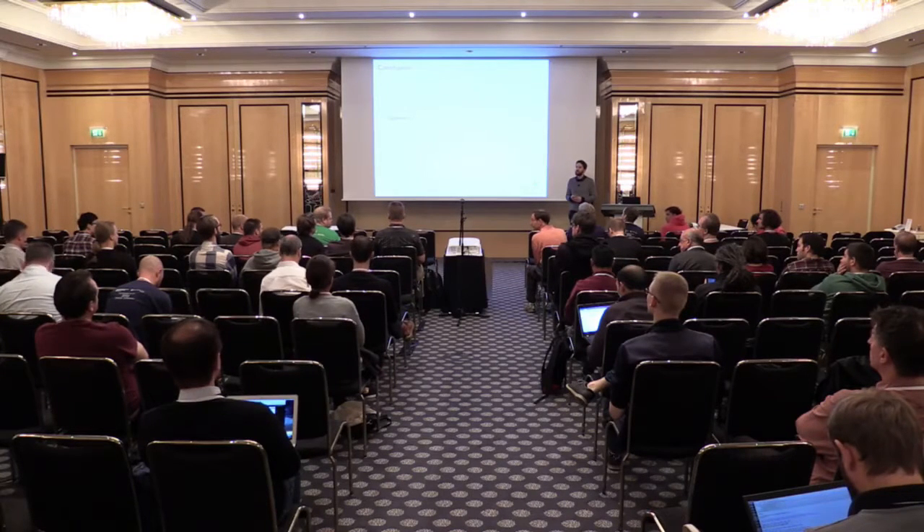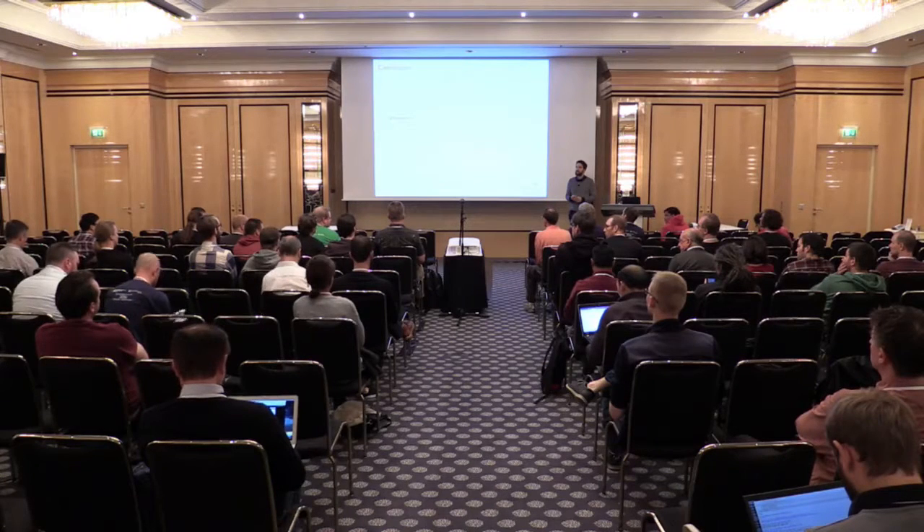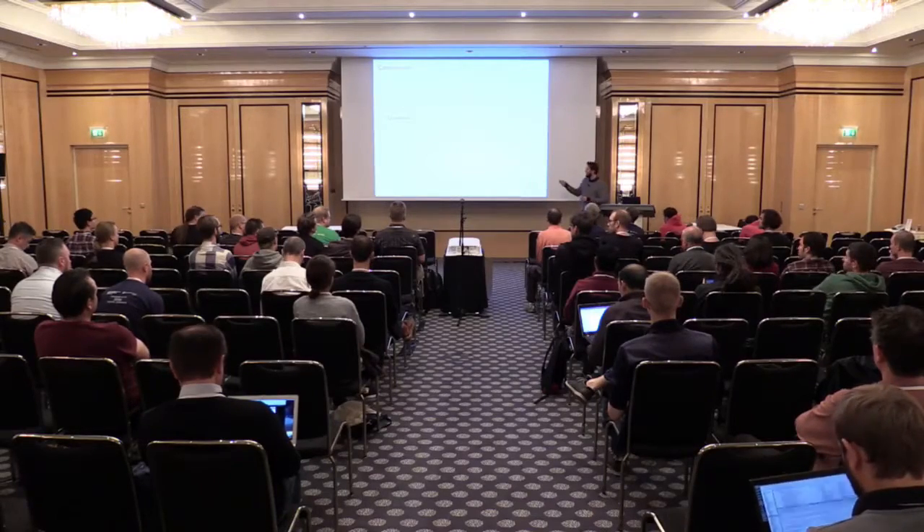A question about the GStreamer pipeline — whether H.264 and image stabilization are done in software and whether there are hardware encoders. On the Bebop we do have hardware encoders, and the stabilization is done over GPU using GStreamer plugins with OpenGL. So we're very backwards on the kernel but very up to date on GStreamer. The GStreamer pipeline shown was on the PC side to decode the stream. On the drone's GStreamer pipeline, we use stabilization via GPU over OpenGL and hardware encoding. On dual Cortex-A9 you couldn't possibly stream at 720p and record at 1080p simultaneously without a hardware encoder.